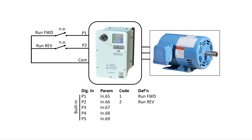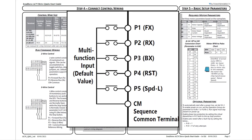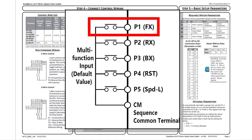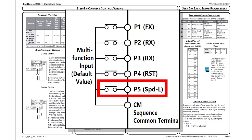If you need to use a different pin, just move the forward and reverse codes to whichever pins you want to use. You can see what the default usage is for each input terminal in the quick start guide — the forward enable and reverse enable we're using in this video, an output block that disables the output of the drive, alarm reset, and the first speed selector bit. We'll cover all of those in other videos.